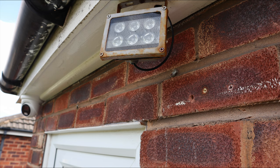And finally, that's the old infrared emitter I used. Like I mentioned before, the dome cams are extremely prone to internal reflections in the rain at night, making the view illegible due to splodges. So what I did was I turned off the internal infrared emitter and I used that one instead, which is more powerful and lit up a much bigger area. It also did away with all the splodging problems. If you haven't seen that video, check it out in one of my other videos and it explains all that in detail. But that's it, and I'll be taking that off because I won't need it anymore with these new cameras.